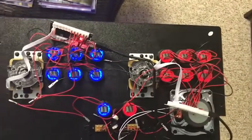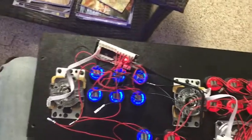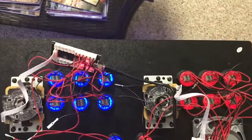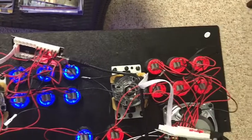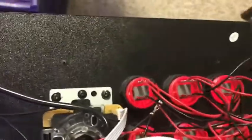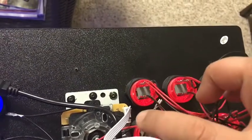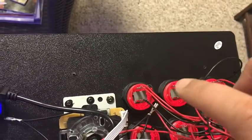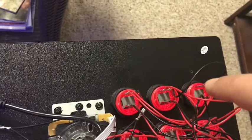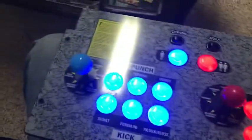Hey guys, just want to show you I've wired everything up. The LEDs are on a daisy chain and they're pretty self-explanatory. Mine is the ETA Prime one, so positive and negative are reversed at the top. But if you notice where this gray connection is on the bottom, these 2 areas here are going to connect into the encoder board for your button control. These top areas are going to connect for your LEDs, and they're just reversed, at least for this kit. You can go online and see what the instructions say. And reversing it, there we go. Voila, looking good so far.